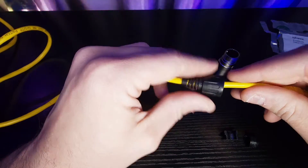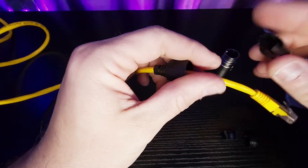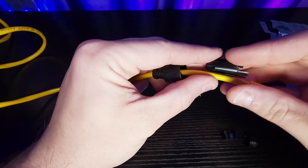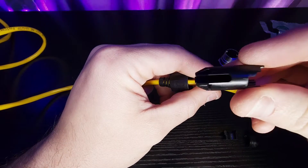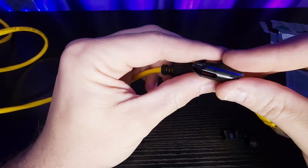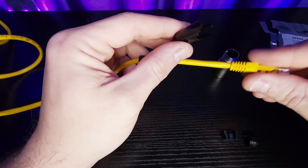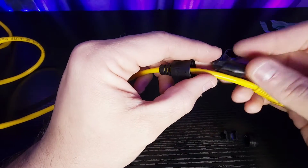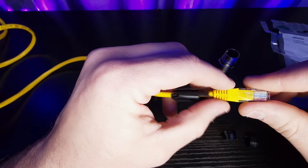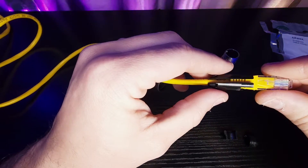As you can see, this actually has a cutout, and the cutout is to slide over your RJ45 cable. This actually has two ends — one's an almost arrow-shaped end that goes in that direction, and then there's a wider end here that goes in this direction. So you can just slide this over. In this particular instance, I would suggest cutting the actual boot off of your already-made cable, but I like to save my cables and I don't really find it necessary to cut that off, and this does slide just fine.